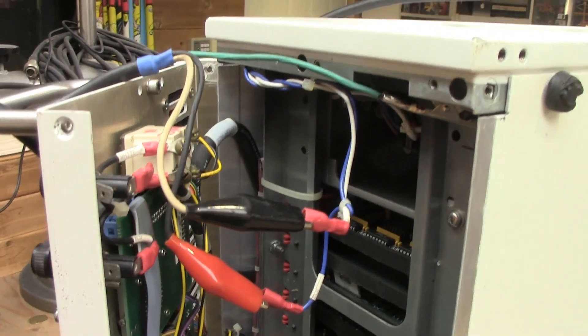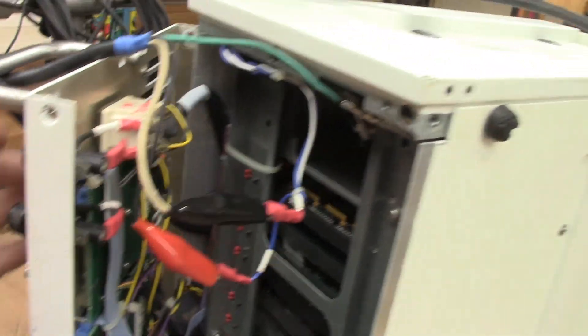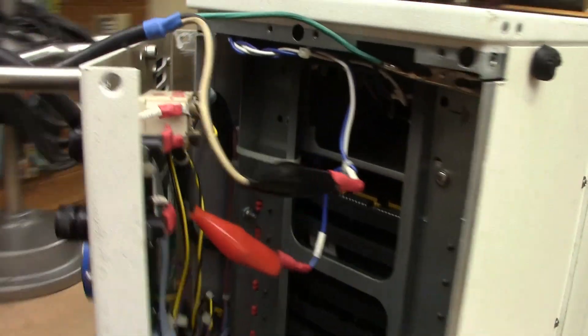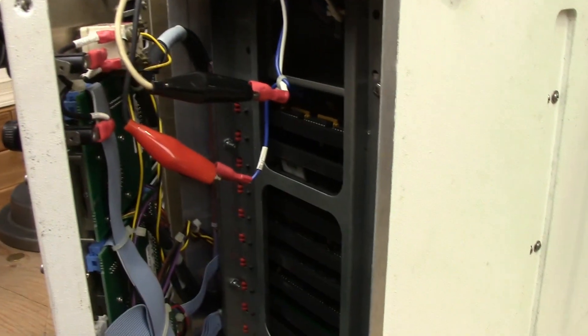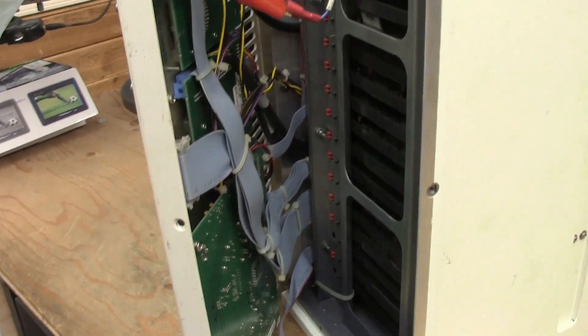Safety officials hate him — this one simple trick gets you electrocuted as easy as one, two, three. I have trust in my cheater cable. Let's turn it on — I should be using the foot pedal with this. Hey, that actually sounds like it's working. The LED is not on, but the fans in this thing are DC, so that means AC is getting in and it's actually bringing up the power supply. Let's attach a monitor. I added a video connection — it's composite — and look at that, I got a test pattern. I actually got text: 'Power off processor before connecting imager.' This is actually working.